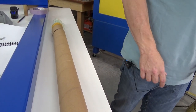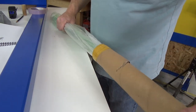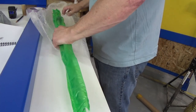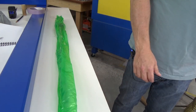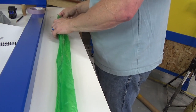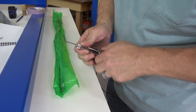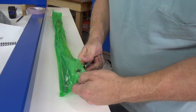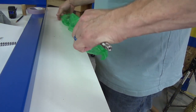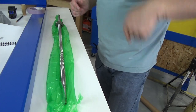According to the manual, what we're going to do now is start working with the ball screw. You really want to be careful how you handle this thing because it is a precision piece of equipment — no banging it around. There are two ends: one's threaded, one is not. We're going to be working with the threaded end first.